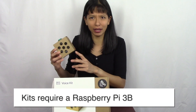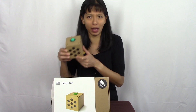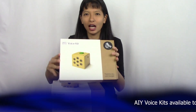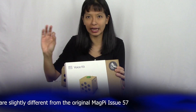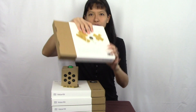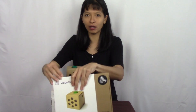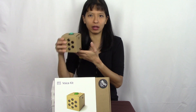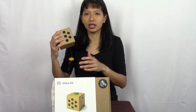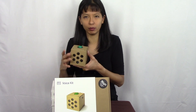You still have to buy a Raspberry Pi, which is $35 to $50. Tip number two: these kits are different from what was given away with the MagPi magazine. They've improved upon the project — in the original kit you had to assemble the arcade button yourself, but now it comes pre-assembled. The install is a bit easier, the instructions are different, and the software has been upgraded. You do have to download the software yourself from the website — I'll link to that below.